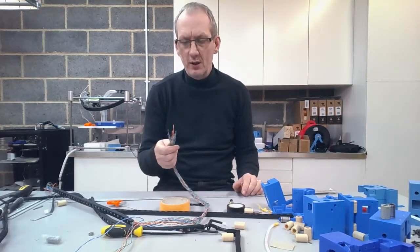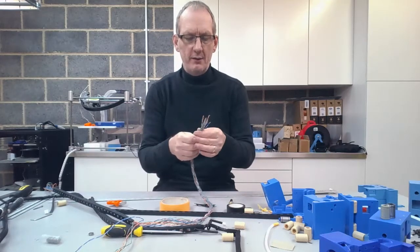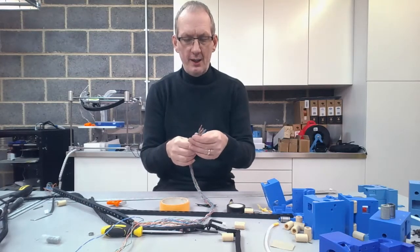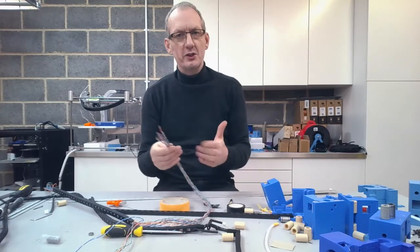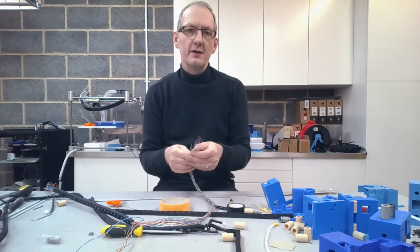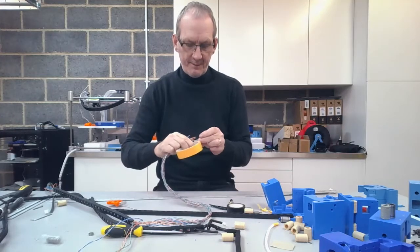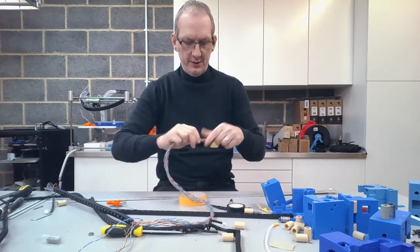We need a total of, depending on how I do the configuration of the wiring on it, I'm not quite decided on this one yet, whether it be 4 or 5 wires for the BL Touch. All it means is I can either give the BL Touch its own earth, or I can piggyback off one of the fan earths in order to do that. So now I'm going to retape those back up, get it nice and tight.